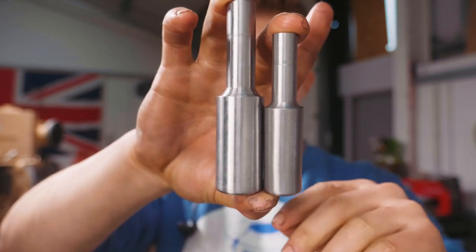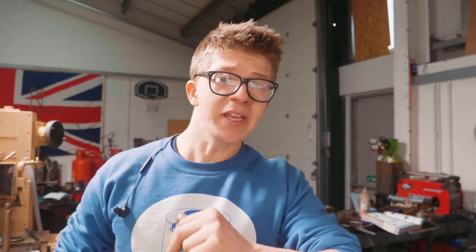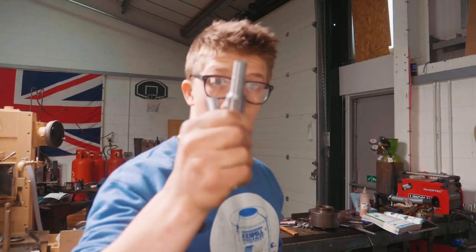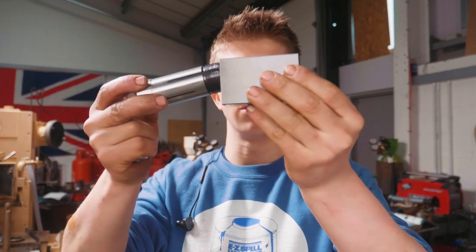We've been making some pretty good progress. Here are how the pieces are looking now — I've scotch-brited them both up a little bit and made a little groove where the squaring needs to end, just so I can see it as I'm milling away. And speaking of milling, that indeed is the next step. We need a square on the end of both of these, and thankfully with the wonders of collet blocks this is going to be rather easy.